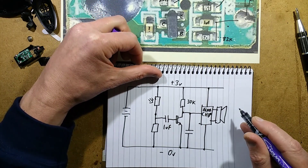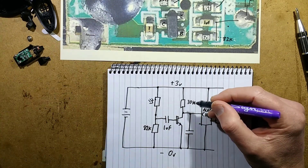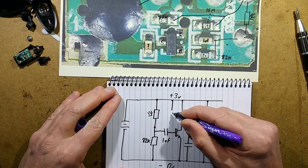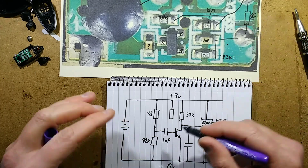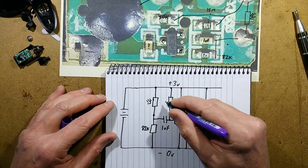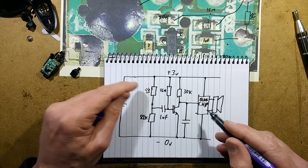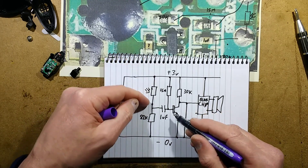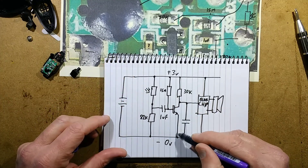Let me fill in the values. That resistor was the 82K. That just leaves the other resistor — the bias resistor — which comes from the positive rail to the base of the transistor. That's the huge 15 megohm, going from the positive rail to the base of the transistor, just to provide a slight bias to start the transistor turning on — it makes it more sensitive. So now, when any light modulation is detected, the voltage variation is coupled through onto the base of the transistor, but only when that actual voltage is fluctuating will there be current flow effectively coupled through that capacitor, which will turn the transistor on.